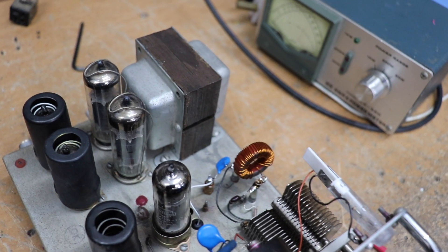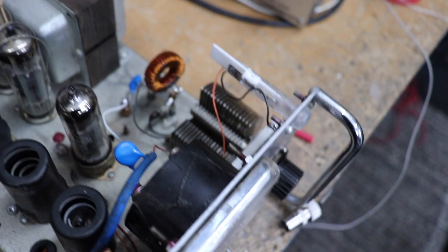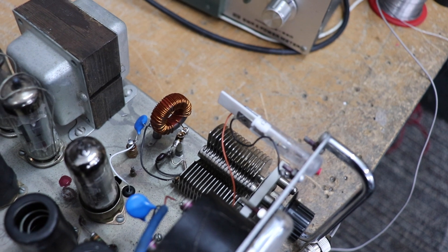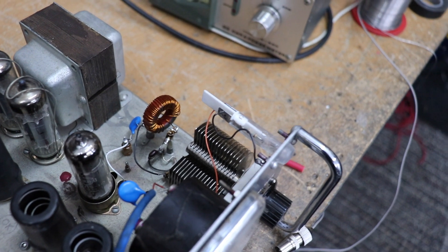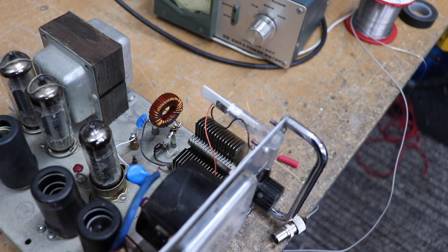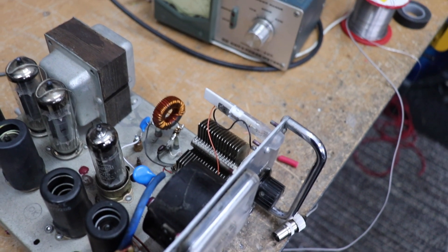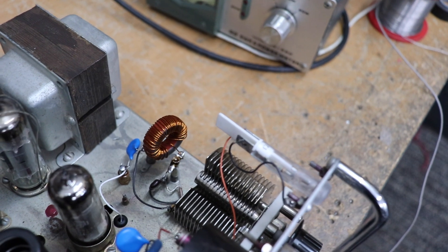There's a nice little cute mod transformer, and the first thing to note is that we've got a nice variable capacitor there and a ferrite core which is our tank coil. One thing I've had to do here is that because space is at a premium, unfortunately I couldn't put in a variable capacitor for the loading — I haven't got enough space.